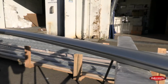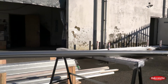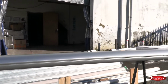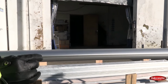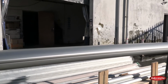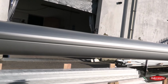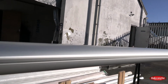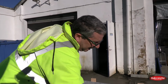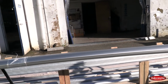Okay, so when you're looking at the rails from the inside on the aerofoil, it's got a very, very low profile, so it's almost invisible. But when you look very close in, maybe put it at a little bit of an angle, you can see the pressure point from the bending. So you can see that. And obviously there are anodized lines which will be on a straight profile anyhow. But that's what one can expect on the bending of the profiles.